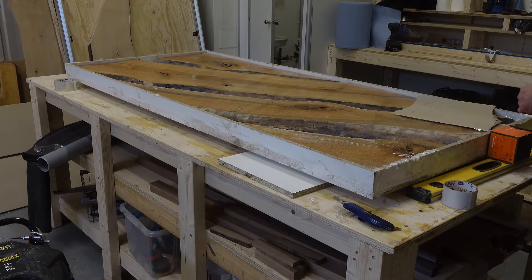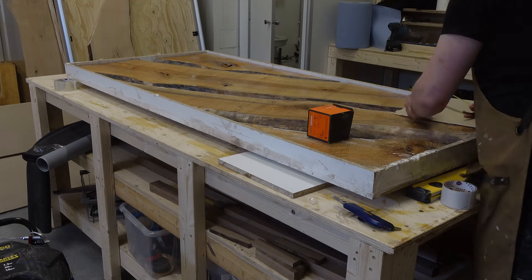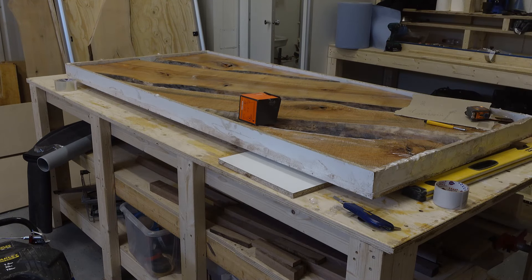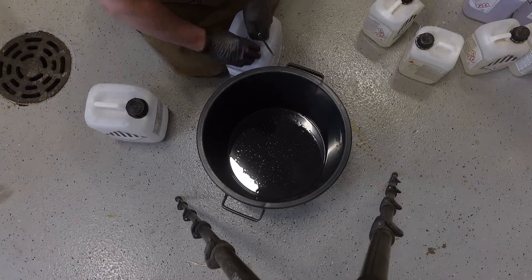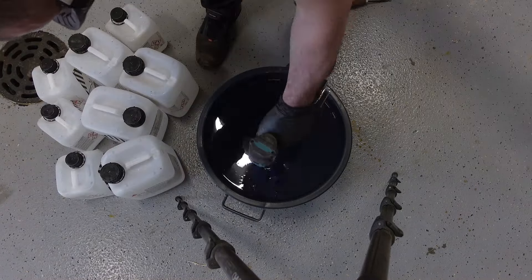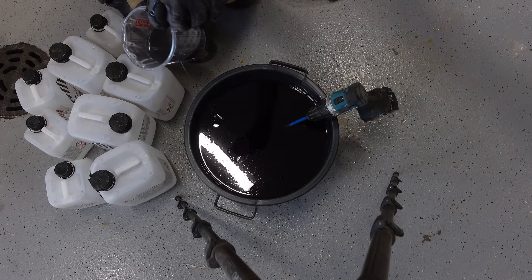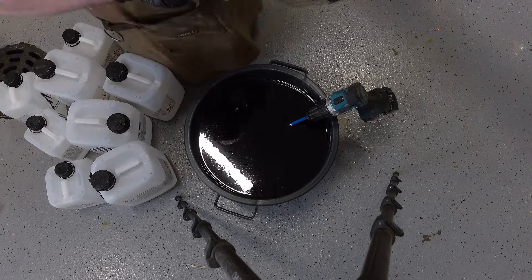For calculating the amount of epoxy needed I'm using the Blacktail Studio method. It's a nice, simple and quite accurate way of doing it, and as I am very bad at math, this actually works great for me. I've added the link in the description if you want to see proper instructions on how to calculate. This is a full-sized dining table so it does take a lot of epoxy, as you can see from the amount of empty cans I have here. I mix the epoxy for at least three minutes and then add the dye — then I check the color and if it's too light I add more dye, like I did.